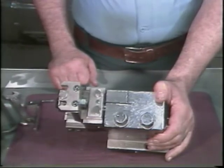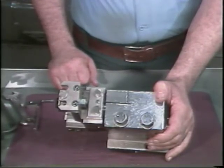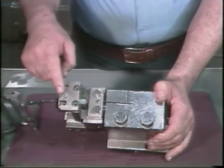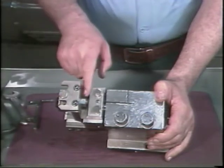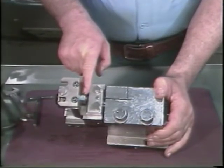The shape of the part being shaved will determine which position should be used. The roller must be set so that it will ride on the largest diameter of the part being shaved. Positioning the roller vertically is done with this adjusting screw. When the roller is in the correct position, it is locked into place by tightening this nut.